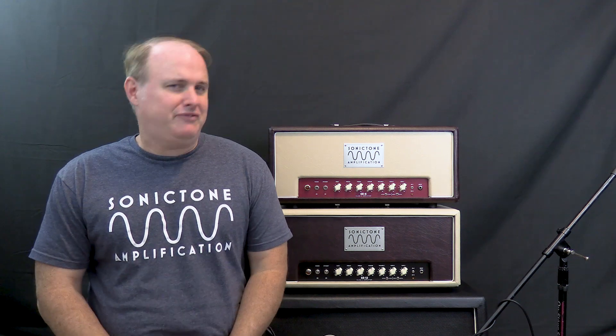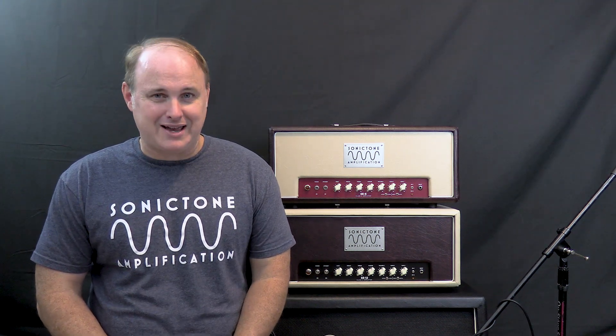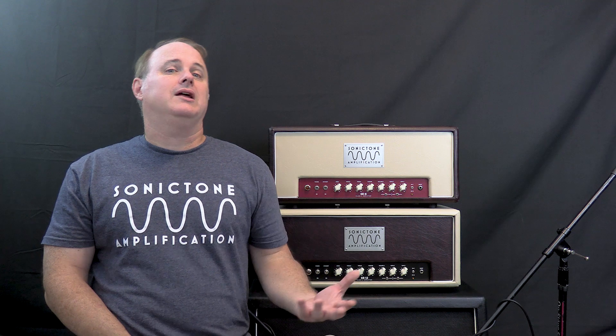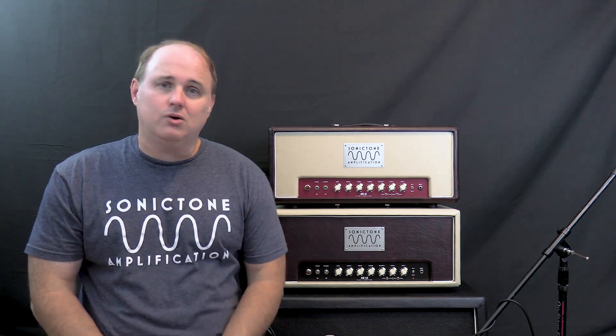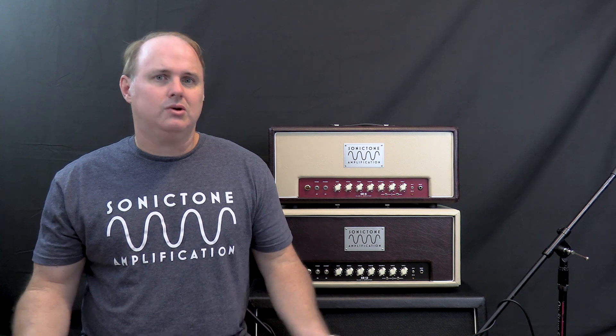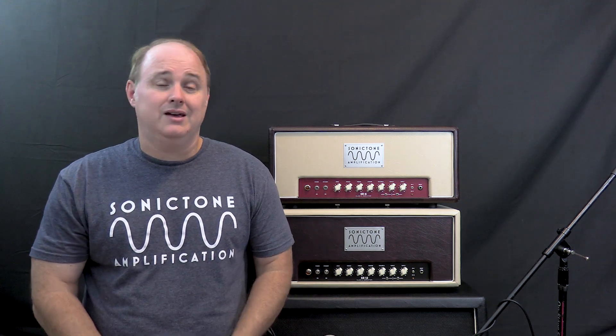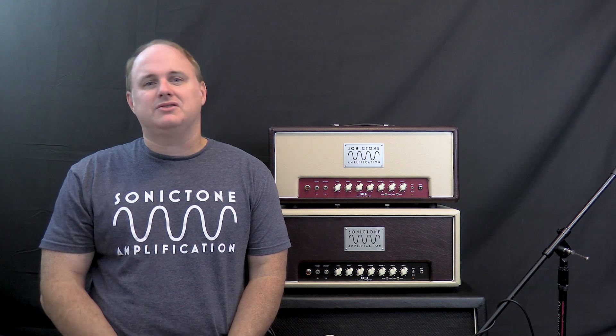So let's go ahead and step into the minefield now. Which is better, Class A or Class AB? Well, you really can't define one as better than the other — it's really about the application. If you don't mind a lower output amp and you want that kind of touch and feel of a Class A amp, then by all means go Class A. But if you want something that gives you a little more headroom and a little more output, then go Class AB. Truth be told, most amps on the market are Class AB. There are very few out there that are truly Class A. In fact, that's a bit of a hot topic because there have been amps famously marketed as Class A over the years that really are Class AB amps.